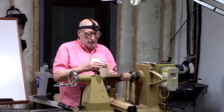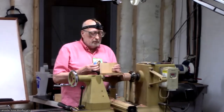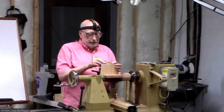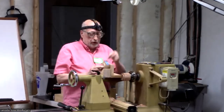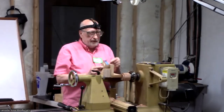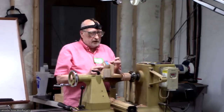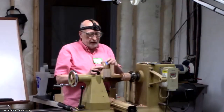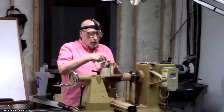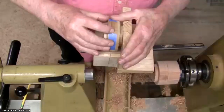on the drill press, there's a center line here, so I can set this up in line with the column and get the drill bit exactly where I want it, clamp this to the table, clamp this to the jig, so that the whole thing is clamped. I'm going to go down in one push, because I found that when I go in and out and in and out, I get a hole that is enlarged. If I want a hole that is not enlarged, I'm going to go into the depth of the wall plus the wall to come on the inside part and bore the three holes. So I'll be boring there, and there, and there.